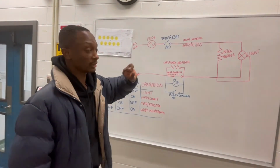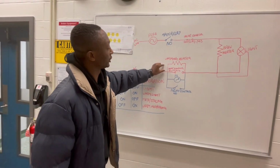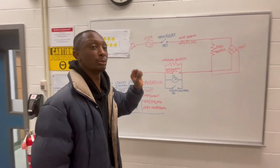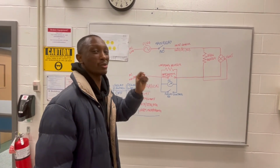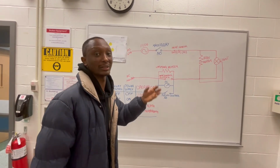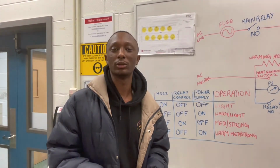So we are recommending as a team that we replace this heat sensor switch with a temperature switch in series with our relay control. And for the safety, we recommend that a sensor will replace the pressure sensor that is used, that will record accurate readings of the water level, so that it won't lead to overheating of our circuit. I would love to hand over to my colleague Lawson to handle the conclusion.